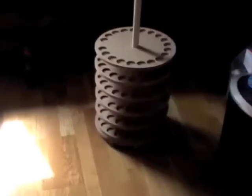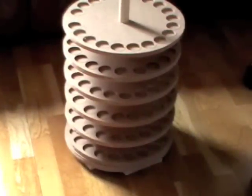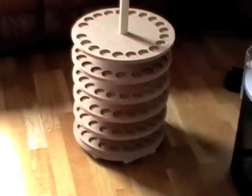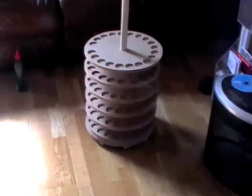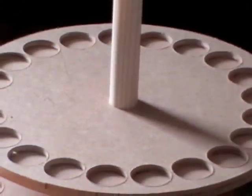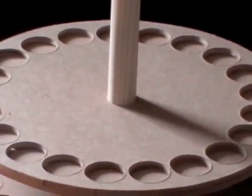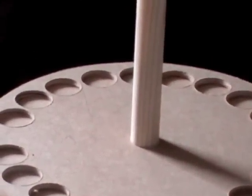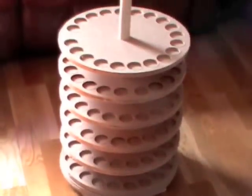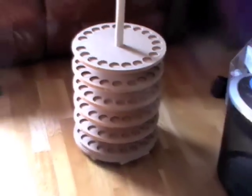It's beginning to take on a bit of a shape now. Got all the carousel shelves slotted in and glued down on top of each other on the spindle. Next I'm going to put a small pyramidal shelf in the centre area to hold my cans of primer and undercoats. After that, chop the handle to an appropriate length and put a finial or end cap on top as a handle. Then prime the wood and finish it off — I've got MDF paint picked up from B&Q — stick some feet in the bottom and job's a good one.